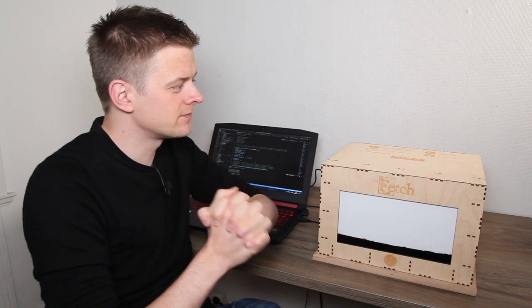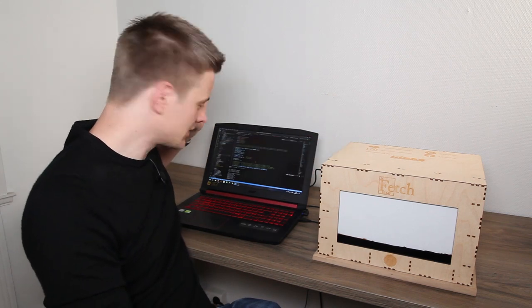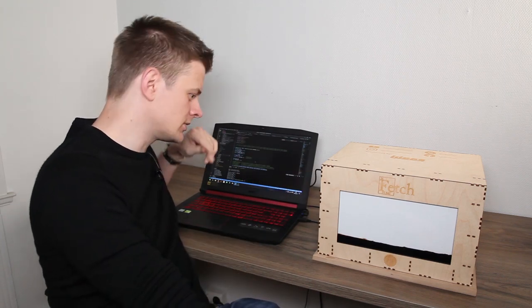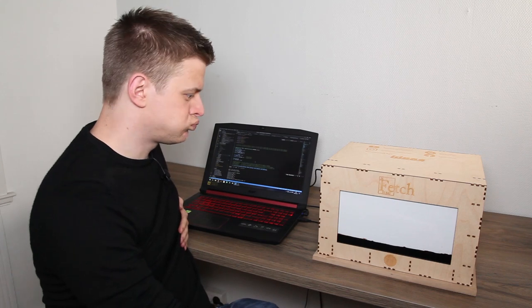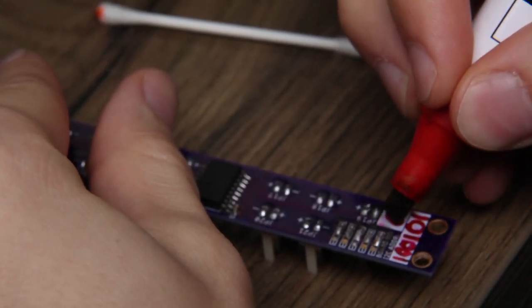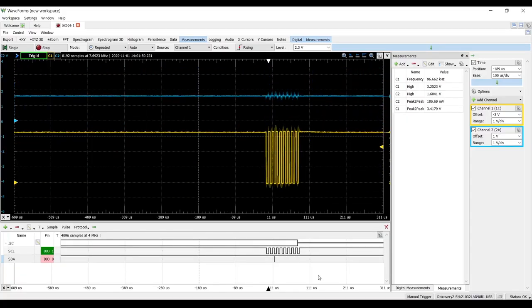Okay, this is the big one. Power on and away we go — but it doesn't work. It says it's playing, but that's a lie. After more debugging we found a couple of major errors: a couple of broken wires (quick fix), a couple of broken PCBs (bigger problem — no spare PCBs, so we had to repurpose from other parts of the display). We also found our I2C bus wasn't behaving properly, so we increased the pull-up strength by reducing the pull-up resistance. Now it finally works.